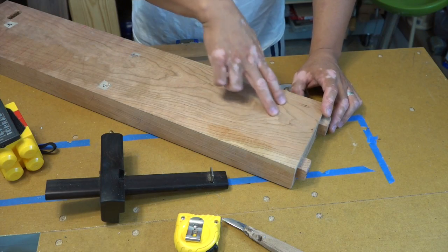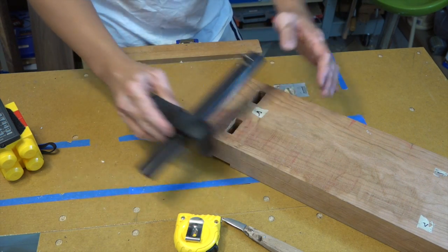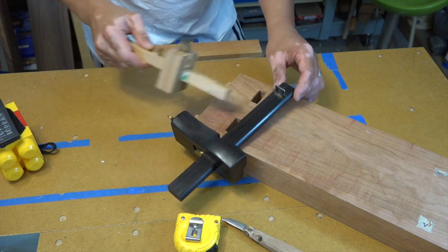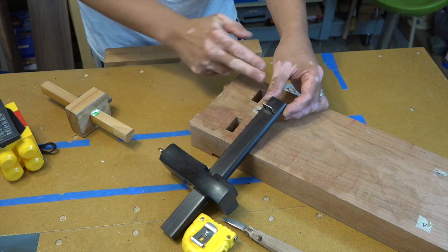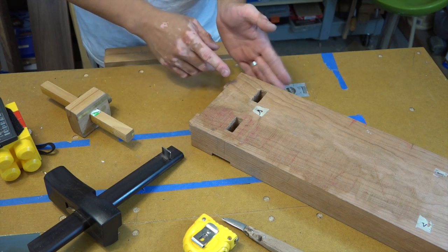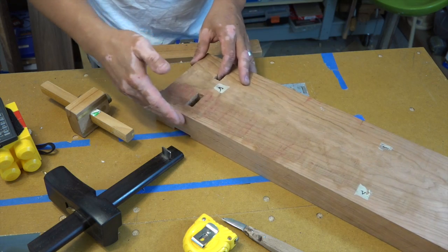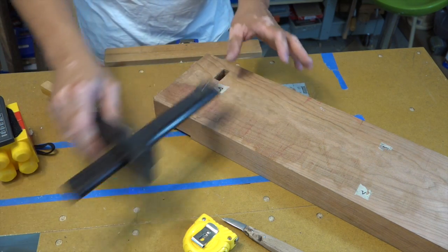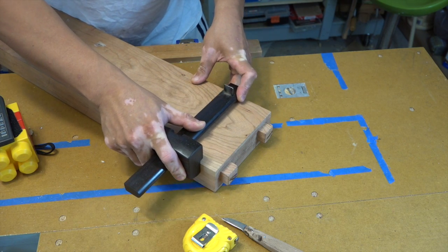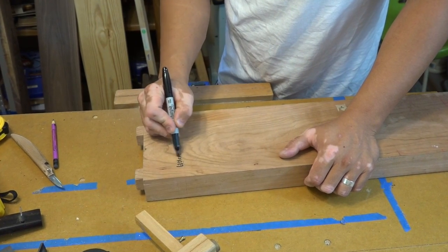To locate the next mortise over here, I again use my reference face. This time I have to use a little bit of a bigger gauge because most of these gauges aren't long enough to reach from this side to make these two holes here. I could measure from this side if I'm absolutely sure this is perfectly square, but just as a habit, I tend to measure from the same reference face. If I have a tool that's long enough to do it, that's what I'll use. Let's go ahead and mark the other mortise hole. So here are the mortises we're going to chop out.